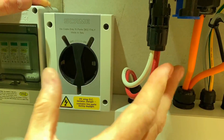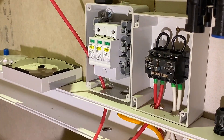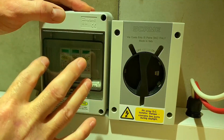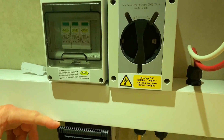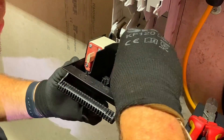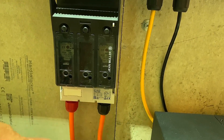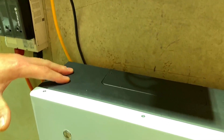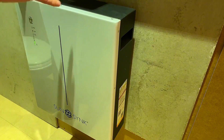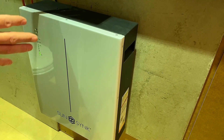Sean convinced me to have the DC isolator because it leads into my DC surge arrestor — so I have surge protection on the DC side before the inverter. Underneath the inverter I can open a panel housing two DC-side fuses. The cables — identified red and black through the glands for positive and negative — run down into my battery. The battery is 5.2kWh, and it'll be interesting to see over time whether I should have installed a second one alongside it.